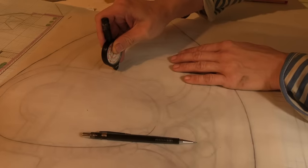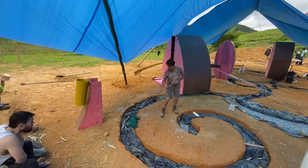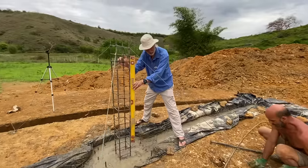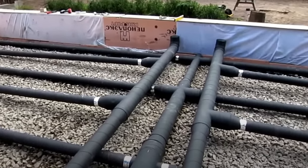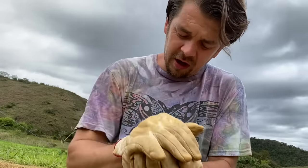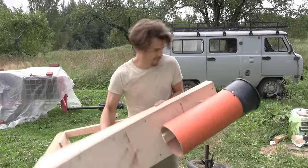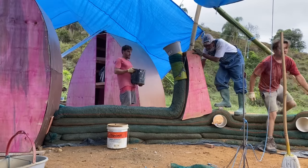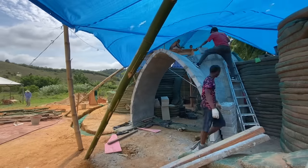In the theory class I will explain the necessary alterations required for various soil types, water table levels as well as climatic conditions — for example waterproofing to avoid the wicking of moisture up the walls, as well as insulation to stop frozen clay from lifting up your home. You will also learn how to do a very simple soil test to get the right mixture for hyper adobe, make basic tools to speed up one-man or multiple-crew construction, and make geometrical door and window boxes used in aircrete domes as well as super adobe walls.